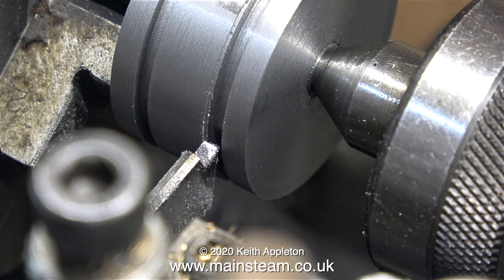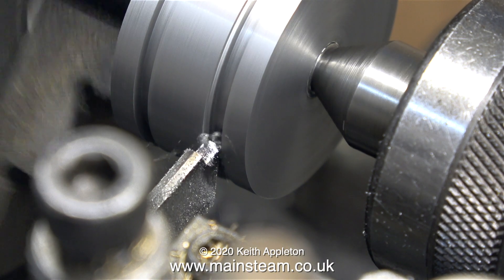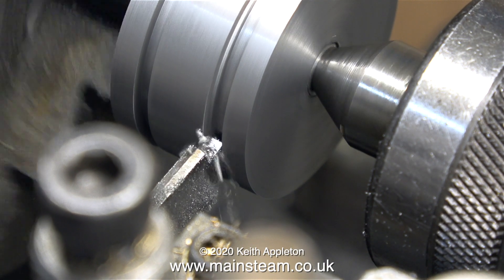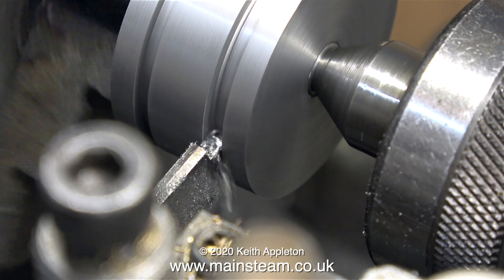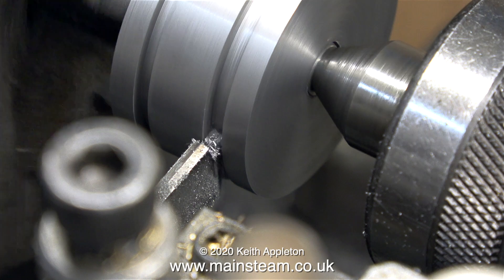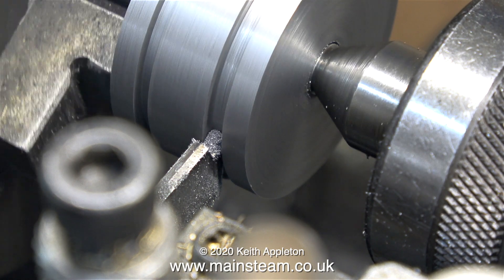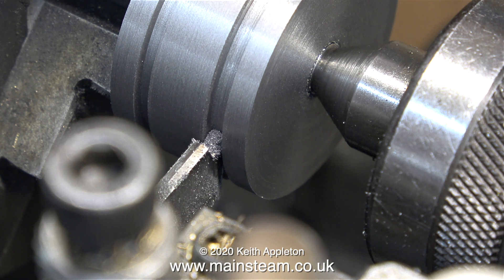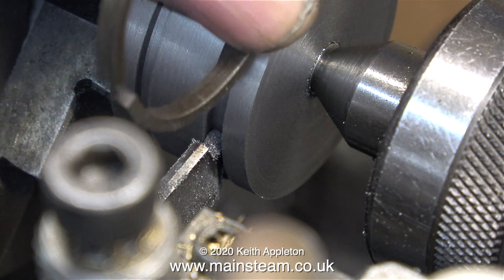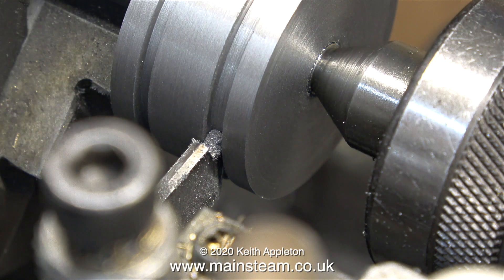Before diving to the bottom of the groove to try the piston ring for size — it's just off camera at the top — it turned out it was still undersized, so I'm machining the groove to the same depth. You have to be very careful with piston rings: you do not want them to be sloppy and you do not want them to be tight. Even though I intend to fit cast iron rings as shown on the drawing, the same tolerances for depth and width apply whether you use silicone rubber or soft packings.